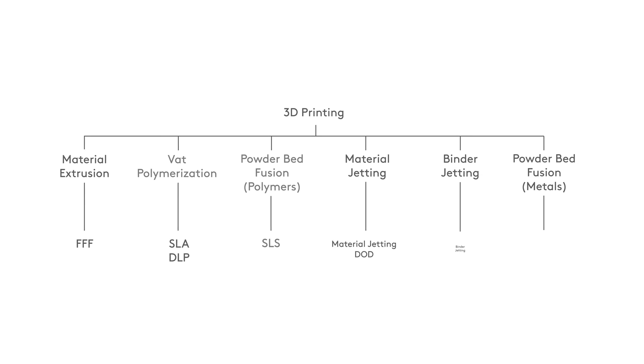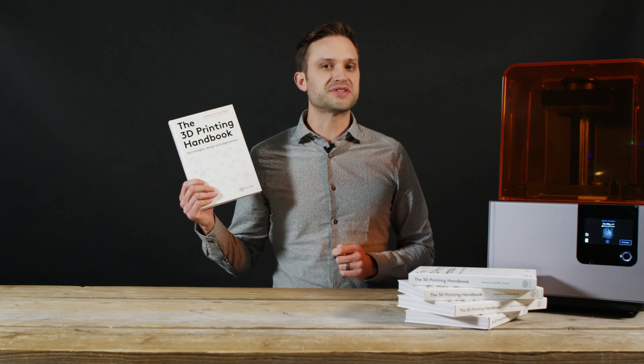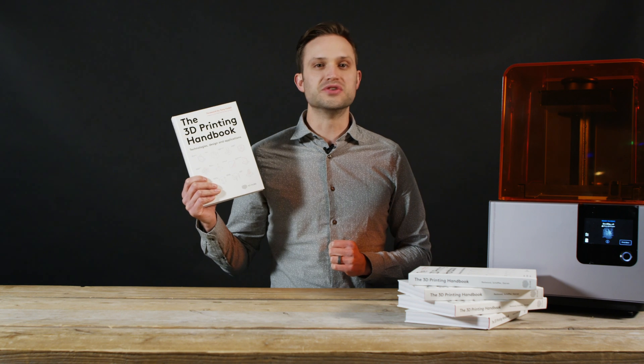So let's wrap it up. SLA is perfect for smaller parts that require intricate details or a smooth surface, but they will be brittle, so keep that in mind. Part orientation and support structures will have a big impact on the surface finish of your part, and there are a lot of materials available in both the desktop and industrial spaces. But if you want functional parts, make sure you look to SLS or FDM. In the next video, we're going to talk about powder bed fusion, or SLS — the best technology for producing strong, functional parts. This video is based on the 3D Printing Handbook. Subscribe to win yourself a copy; we'll be giving away 10 every week to new subscribers.